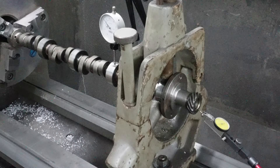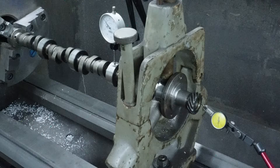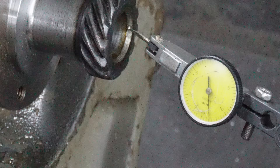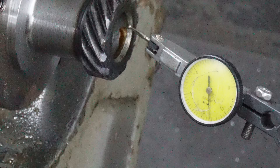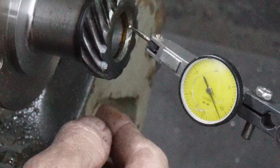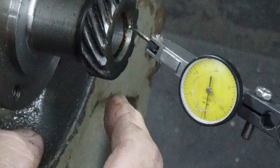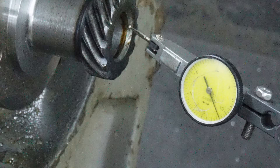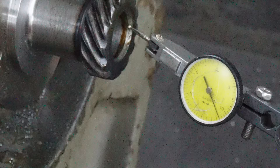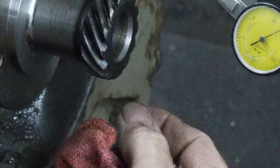So now I'm going to turn this where you can actually see the indicator. So we are on that 30 degree taper and you can see it's got a lot of runout. And - do I see a little place right there? Yep, something has got in there at some point and bumped that center. It's out of round either way, but there's an actual little burr in there just making the indicator jump. I can see a little bump right there.